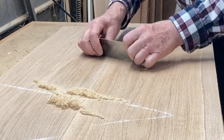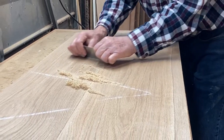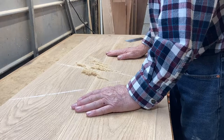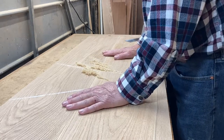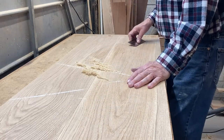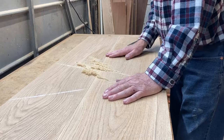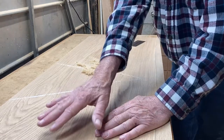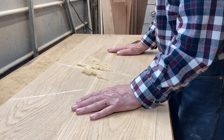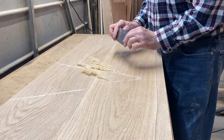That is almost ready for a final sanding and finish. So there's my preferred way — everybody has their own choices. The joy of woodworking is sometimes the quiet and solitude of using hand tools. The joy of woodworking is also moving on to your next project as quickly as possible with the same results. If you want to get there fast, use the belt sander — you take a little more risk of damaging the wood. Or you can take the slow and quiet way, which I prefer a lot of times: use a hand scraper.